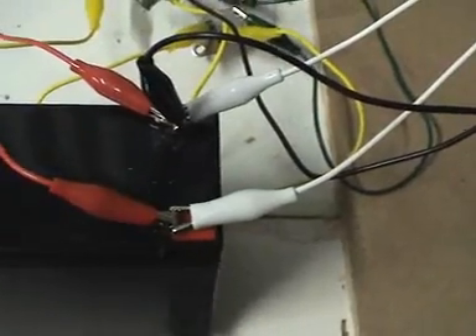Going to get another close-up of these sparks. I'm actually moving the second reed switch out a little bit around to try and get the timing just right, then we'll get back to just the one again. Now I've got the coil that's driving this relay — if you follow these white wires down, it's actually connecting to my charging battery, so I'm pulling power off the battery that's charging.